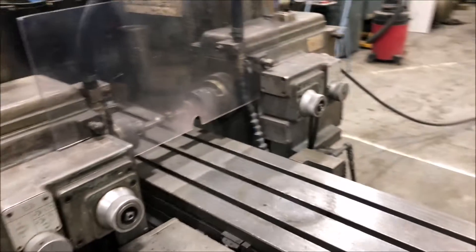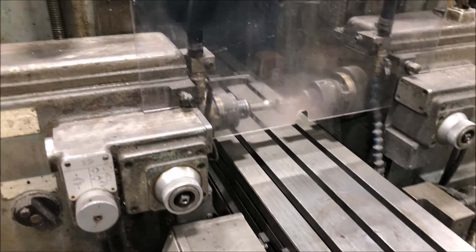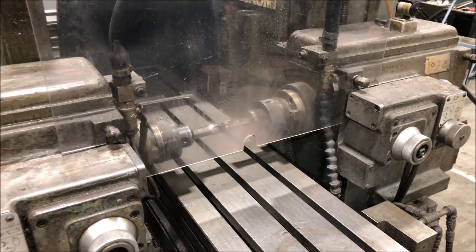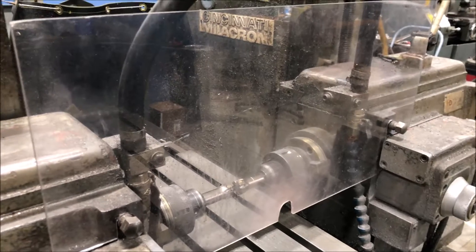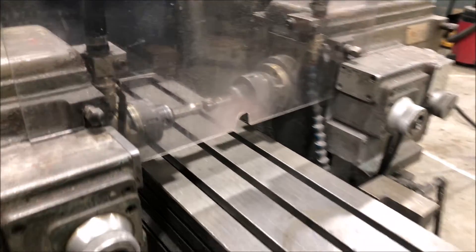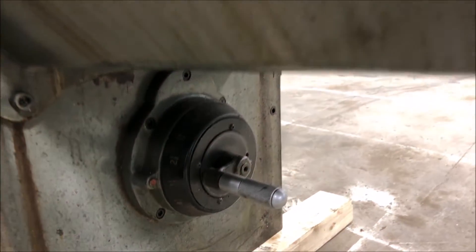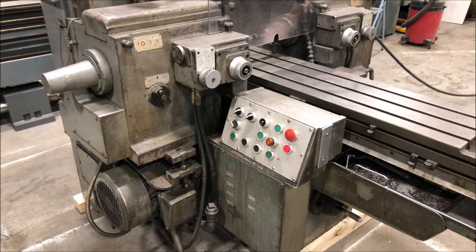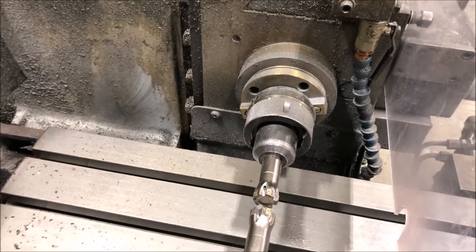These have a 12 by 54 inch working table, 24 inch travel, 8 inch vertical adjustment, 3 inch adjustment on the quills. Again, auto quill retraction. Spindle speeds are gear change — 16 different gear changes, 50 to 2000 RPM. The table feed is adjustable through this dial here. It has two 5.5 horsepower motor drives, one on each spindle, and 50 taper on the spindles.